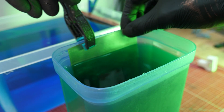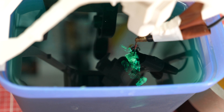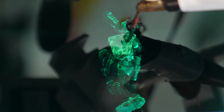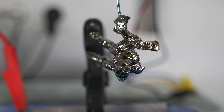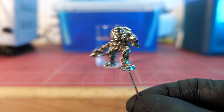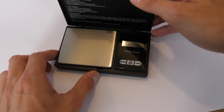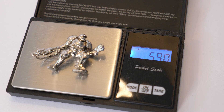Other metal layers, such as nickel, can also be plated — though I generally advise against nickel as a finish layer as it is a contact allergen. The process is the same as with copper, except that you may be working with different voltages. When done, wash the electrolyte off with distilled water. Now let's see what this figure has gained in mass: the raw resin print weighs just under 4 grams and the plated one 5.9 grams — that's almost 50% more mass and you can feel that too.